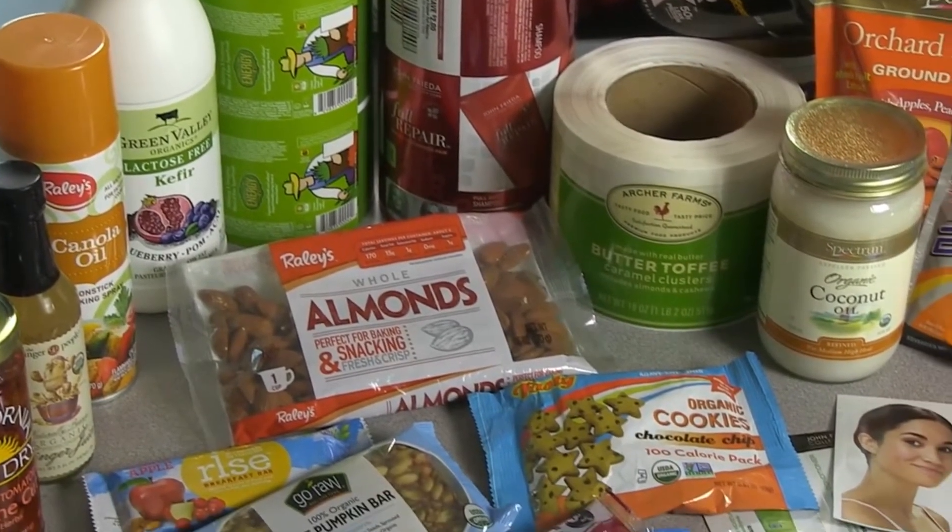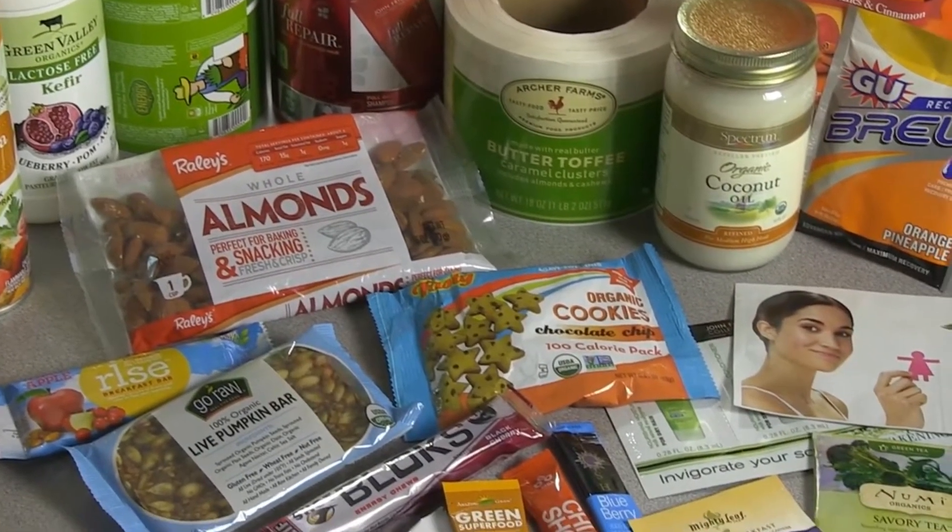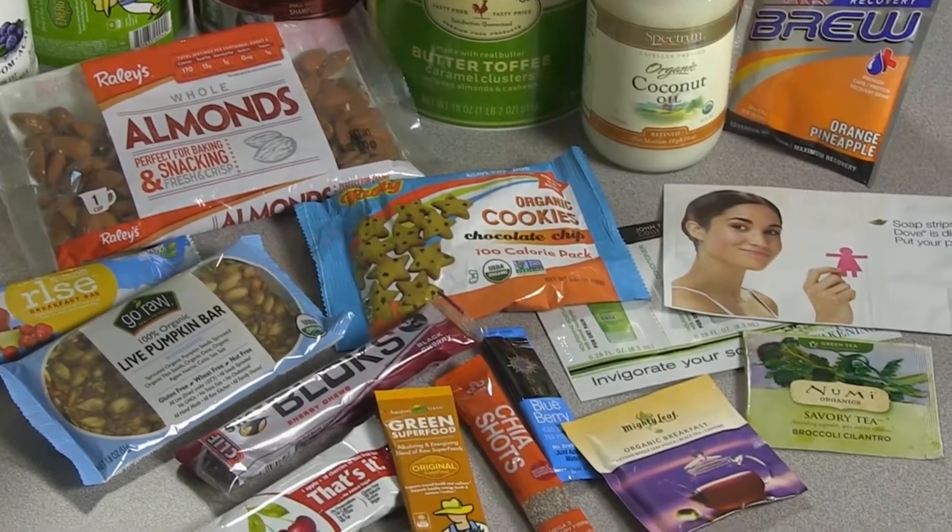Just a rough outline of what web-fed means: it means one continuous sheet of paper, not cut paper. Now, some of the materials that flexography can print on are both non-absorbent and absorbent materials. This is because of the way it's printed on a raised surface and forced on. That's why flexography is used for printing on chocolate wrappers and shiny surfaces. It can be printed on paper, but it's mostly used for plastic bags and stuff like that.